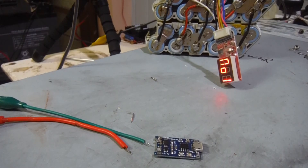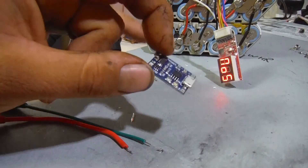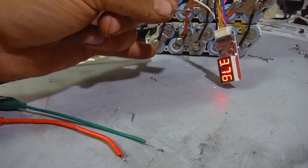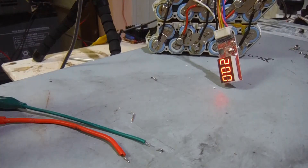When the green light's on — the cell logger will tell me as well — the pair of cells will be charged up to the right capacity. This is about 6 amp hours in capacity per line, so at 3.7 volts this will be 6 amp hours, another 6, another 6, another 6, another 6. So if you were to bridge them all together as a 3.7 volt battery, you'd have a significant 30 amps. But the way they're configured is in a 5S configuration, so it's the way it is out of the factory — an 18 volt battery. Essentially it's just two batteries chucked on top of each other.